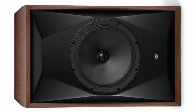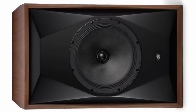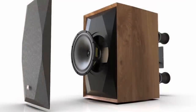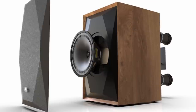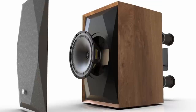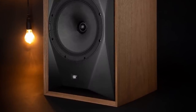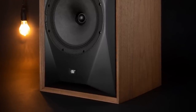The mid-woofer is a paper cone with a shape chosen not only to minimise resonances, but also to act as a waveguide for the tweeter. The low-profile corrugated surround is designed to ensure minimal disruption of the sound wave from the tweeter as it propagates across the cone and beyond. The front baffle, sculptured from 2-inch 50mm MDF, is faceted to help deal with edge diffraction issues. While not as effective as a curved surface, Andrew Jones describes it as a close approximation — though the sharp lip on the edge is an aesthetic consideration that I'm less convinced about.